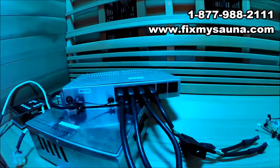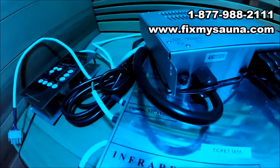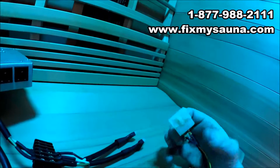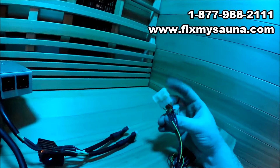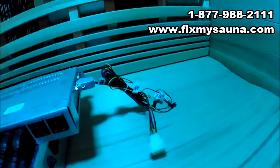So we've got all of your existing connectors plugged into our box with our connectors. The other thing is we had the 12-volt DC output — that output is on this cable here. We took that connection off and put it on the 12-volt connection on ours. This will plug straight into the CD player or 12-volt lighting on this one. So this CD SIG cable goes in just like that and connects in.